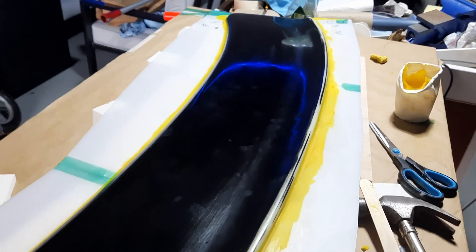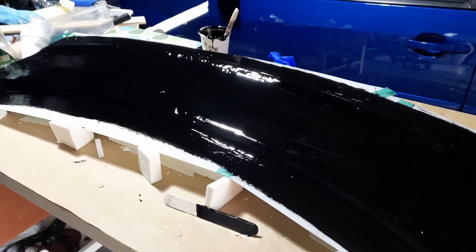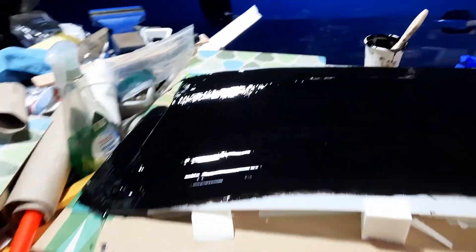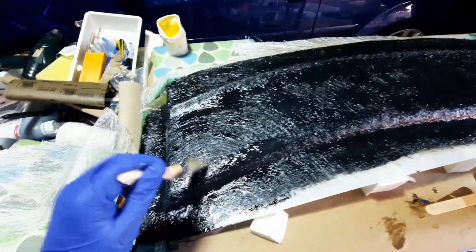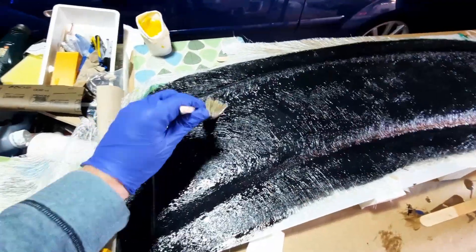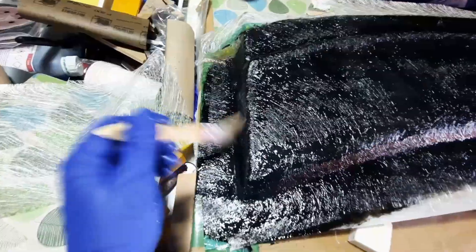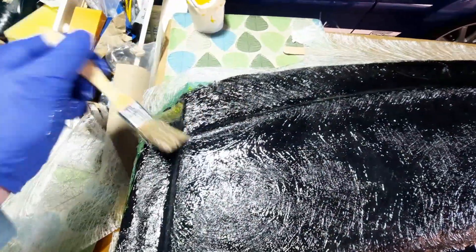It's starting to come together on the top surface now. That gets coated with gel coat, left to cure for probably four to six hours, and then a very fine tissue is applied over the top. I'm using a stippling motion with a brush to drive out all the air bubbles. That first coat of very thin glass fiber is really important to reinforce the mold — any air bubbles will probably lead to the gel coat coming away when you use the mold later, so it's worth investing extra time.